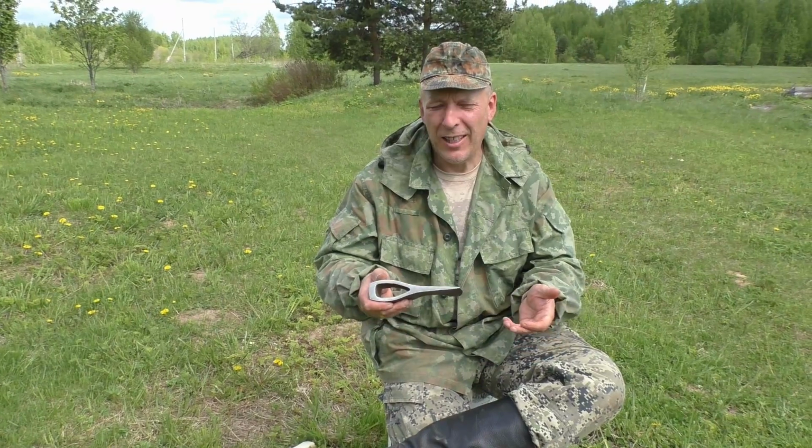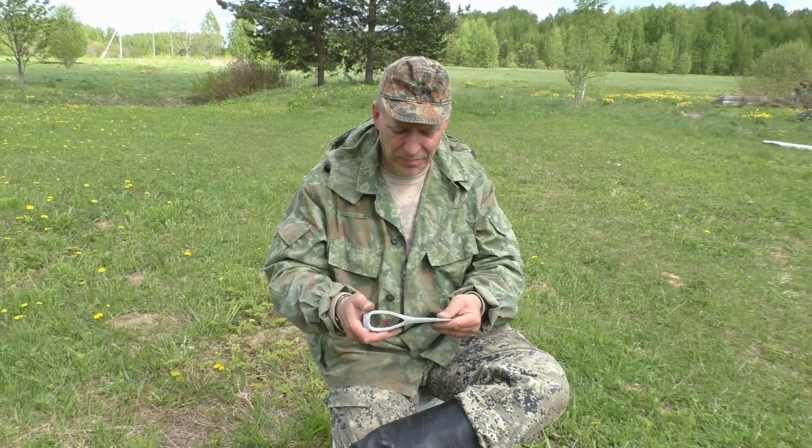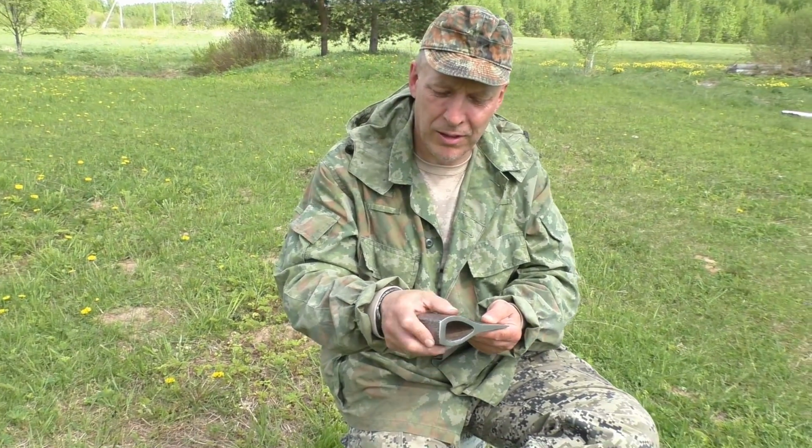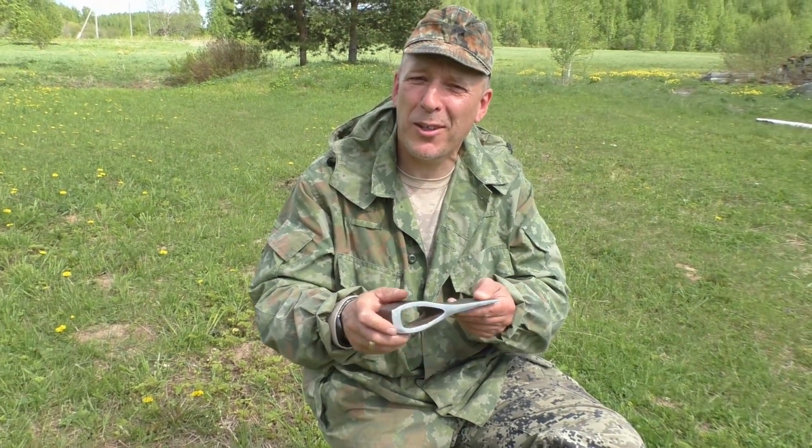About the acetone and transmission fluid hack, you can call it, or rust cleaning, it really works awesome, but I normally used it for non-treated materials like bolts and nuts and sprockets, gear wheels and stuff like that. And for clean rust, it does really well, but obviously there's an old patina left on it that does not really want to come off, and I actually doubt that I want it to come off.